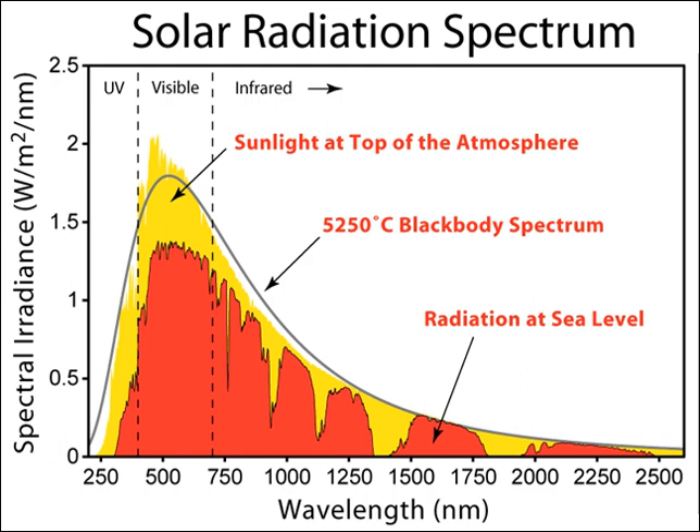The overall achieved conversion efficiency of this device is around 10⁻⁵%. Nonetheless, optical rectenna research is ongoing. The primary drawback of these carbon nanotube rectenna devices is a lack of air stability. The device structure originally reported by Kola used calcium as a semitransparent top electrode because the low work function of calcium relative to MWCNTs creates the diode asymmetry needed for optical rectification. However, metallic calcium is highly unstable in air and oxidizes rapidly. Measurements had to be made within a glovebox under an inert environment. Kola and his team later solved the challenges with device instability, and in 2018 reported the first air-stable optical rectenna along with efficiency improvements.